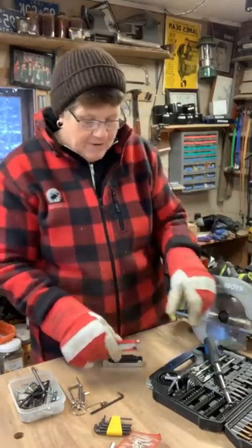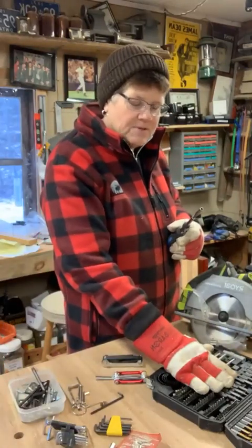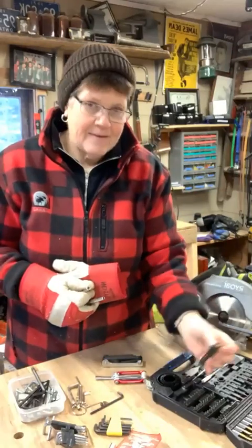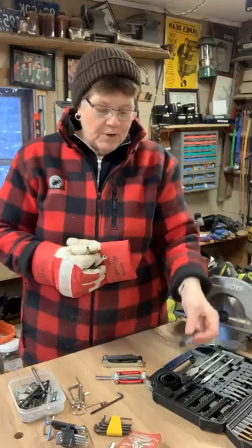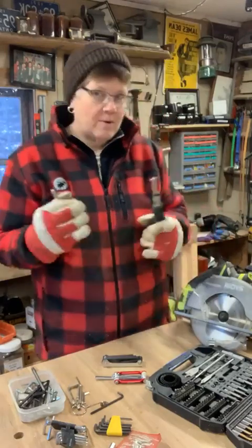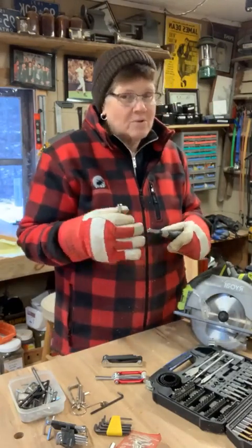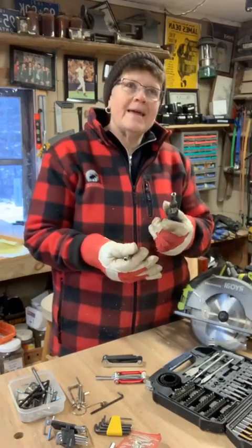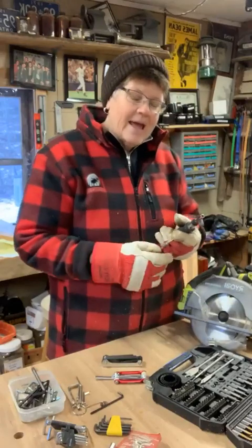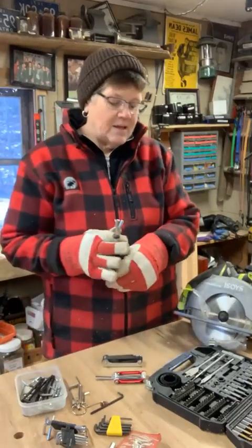The other type of Allen key that you would have is a driver Allen key. When you get some of these screw sets, these driver and drill sets, they actually have a little sleeve, and they will have Allen key heads, the hex heads, in the sleeves that we would put in a hand driver. Now, pro tip, I actually have a little battery operated tool. It's one of my favorite tools, and I use that for furniture assembly. Whether it's the Phillips, Roberts, or hex, I use it to insert the screw, because they're usually an inch long at least, and sometimes a lot longer. So I'll use it to drive it in, and then I'll go back to the L-shaped one to give it that final little wrench. So that's when Allen keys are used most prominently.